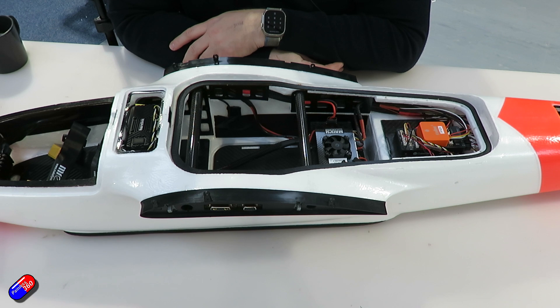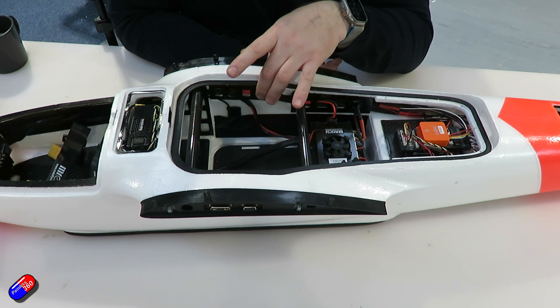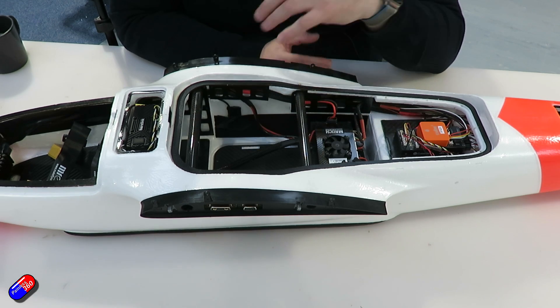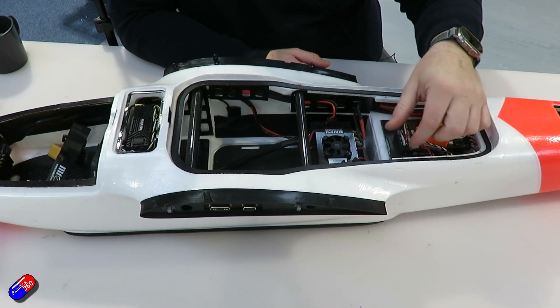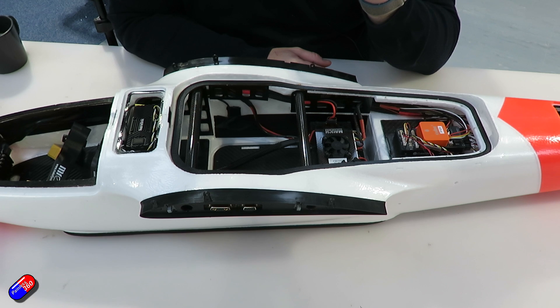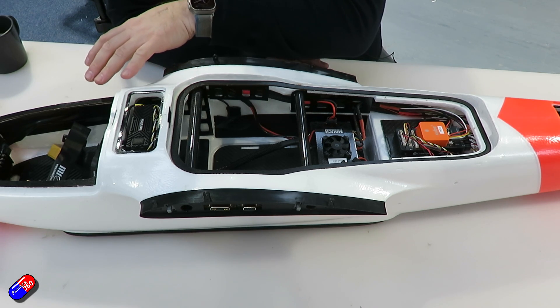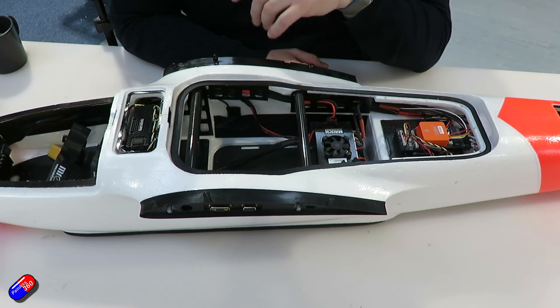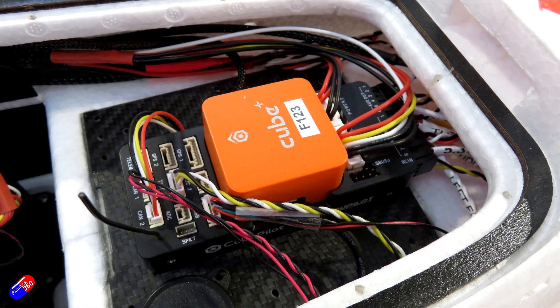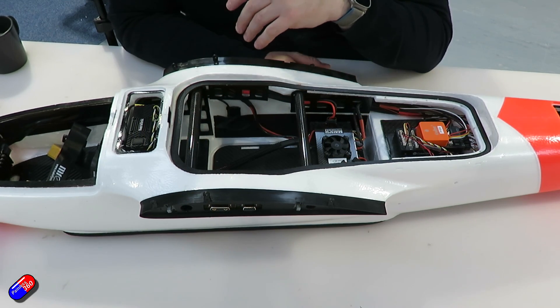There's quite a lot of nice wire routing methods and retention included in the kit — screw-on panels, cable routes to keep things tidy. There's even a 3D-printed enclosure for the flight controller that hides almost all the wires. We do a couple of extra things ourselves: reinforcing plates over the battery mount, an additional plate in the bottom, and the flight controller is on a carbon plate instead of a wooden one, for a bit of extra strength and to make sure the battery can't come undone.